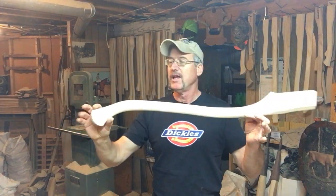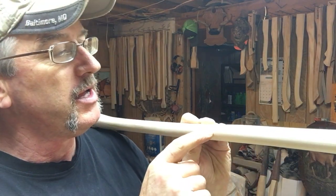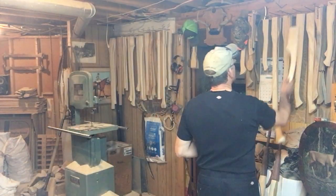Here's a beauty — a French curve hickory handle. It came out really nice and feels awesome in the hands. But when I was doing this one up I saw a real hairline fracture right here. What likely happened is when the handle didn't split nice I flipped it over and tried from the other side — I split from both ends and that little hairline fracture is the result. Right now you don't even feel it, but as time goes on it's going to catch and it's a weak point in the wood. If I can catch that stuff, it does not go out the door.